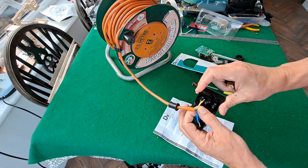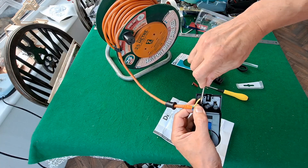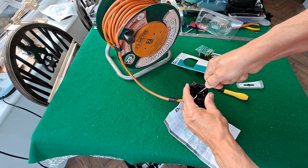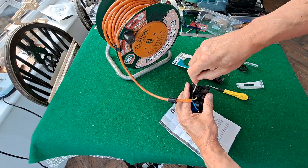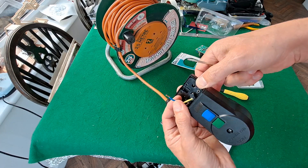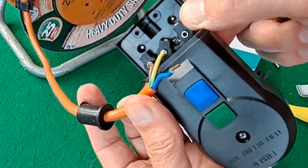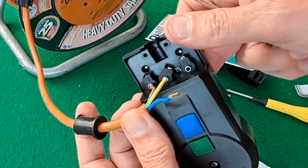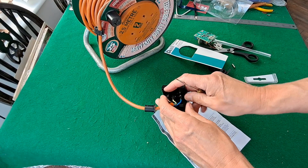That was a good start — I was pushing it in the wrong place. Right, that one's in there. So brown is live, yellow-green goes into the one with an earth or ground symbol on it. Then blue, as I was explaining, neutral goes into the one with an N on it. There's the L terminal, there's the N terminal, and that one's the ground or earth. That one went straight in with no trouble.